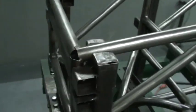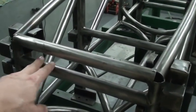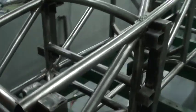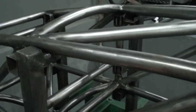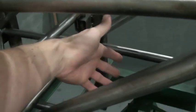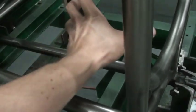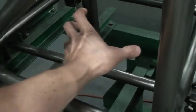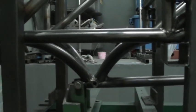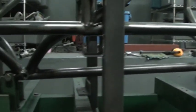Here's a quick overview of the nose. This is where the springs and shocks for the front will mount, between these two members here. The rocker arms — front rockers — will mount up in here. The brake master cylinders will be in this area. There will be an adjustable piece that goes from here to here, with the brake pedal cluster moving back and forth as an assembly. Down here is the front keel — it's a keel-type design, like a Formula One car from maybe eight or ten years ago.